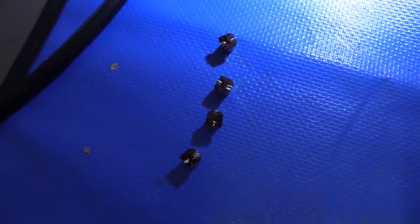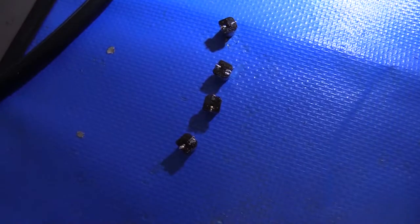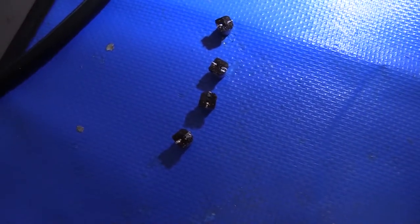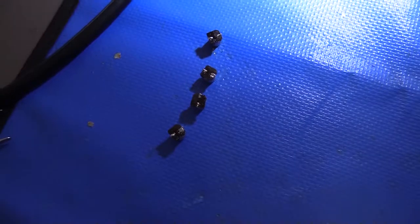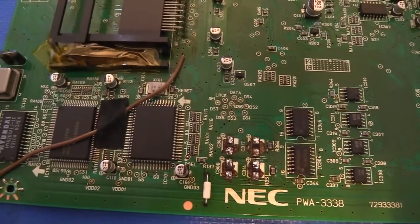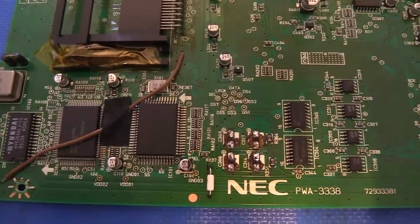Yeah, you can see they're kind of wet on the bottom and kind of gross. Those little plastic bases act like little cups and hold that electrolytic until it starts spilling over the edges or leaking between the legs. It's pretty disgusting, and it can just eat holes in your electronics. And we definitely got to get all of these serviced as soon as you can.